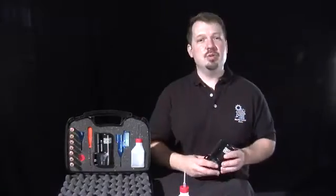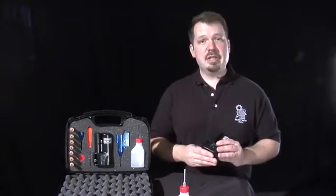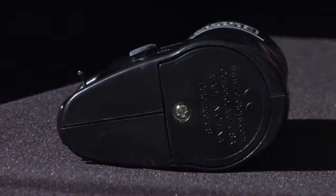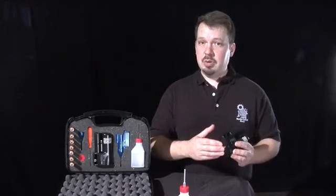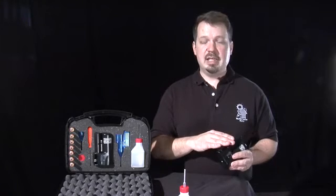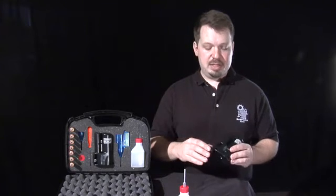This is how you use the Smoke Pencil Pro. The first thing you need to do is put batteries into it. Right on the underside here is the battery cover. You would use a small screwdriver to take off the battery cover, and then put six AA batteries in the bottom of the unit. You can use alkaline batteries, but I recommend rechargeables because it helps the heating element last longer in the device.